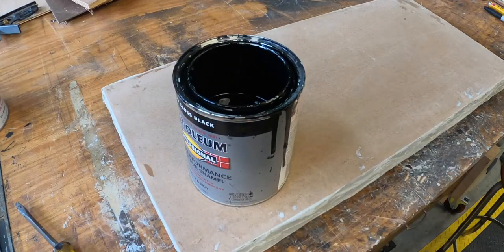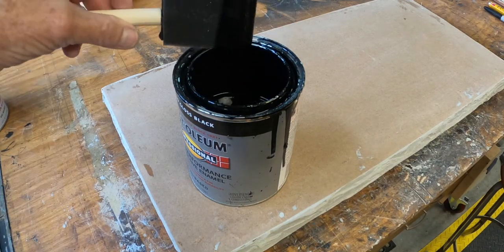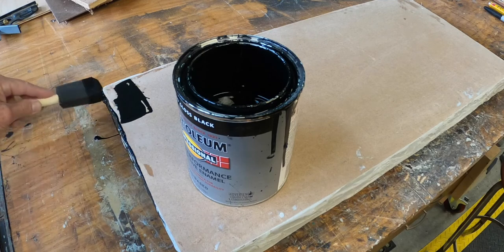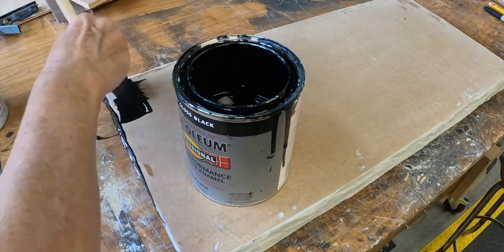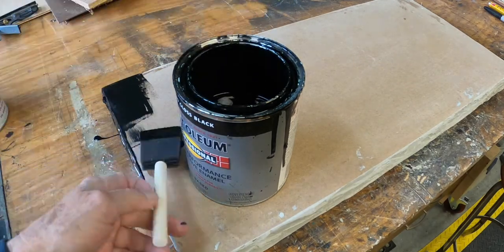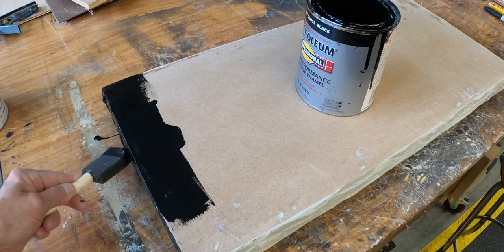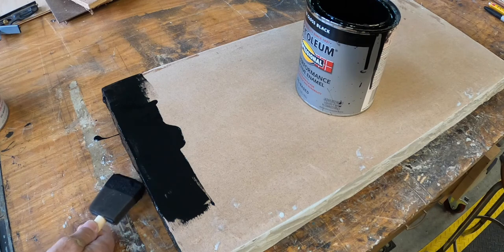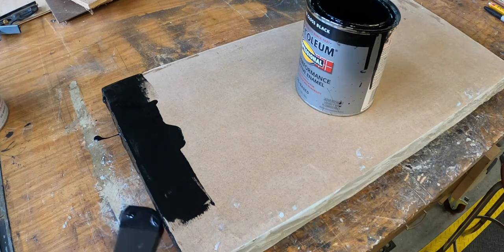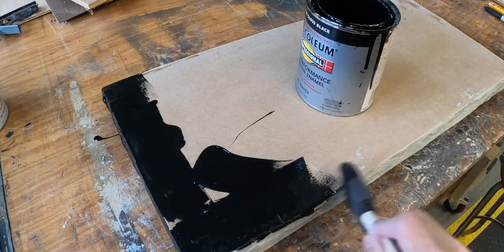The next stage is putting a coat of oil-based black paint. I use black because it falls back, so when I put on the resin I'll put some Pearl-X in there that's black and it kind of hides. I do this on all four sides and also on the top and bottom, getting into those little grooves. I'm using a foam brush here to get into those little undulating features on the edges. Use a foam brush — chip brushes can leave fibers and create dimples, so stay away from those.